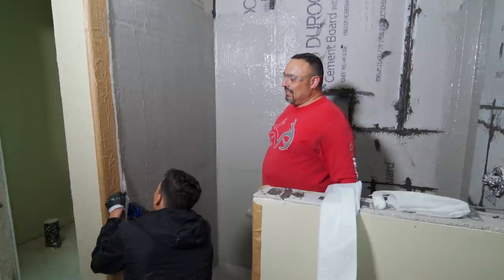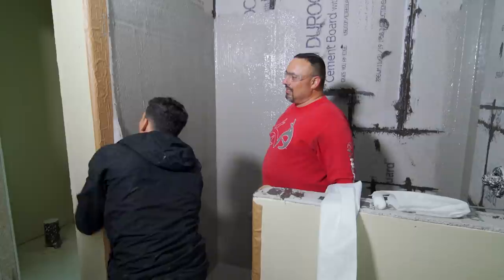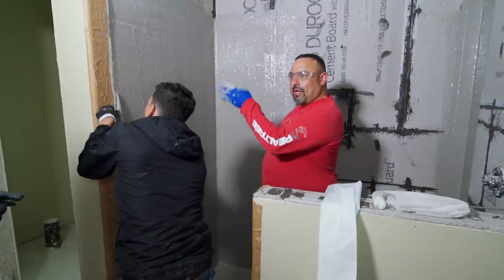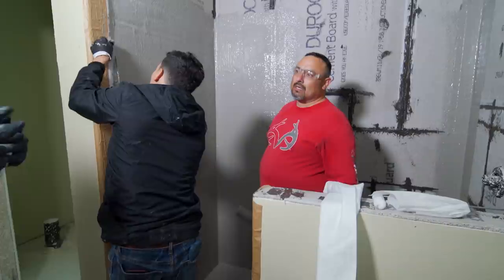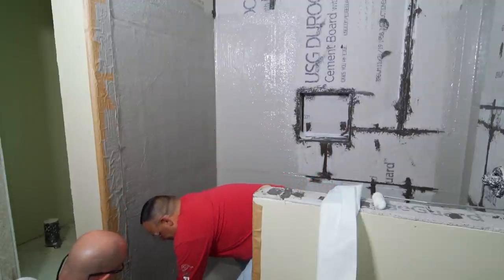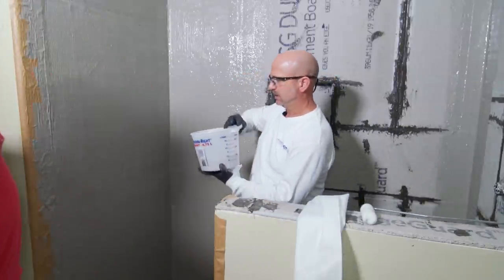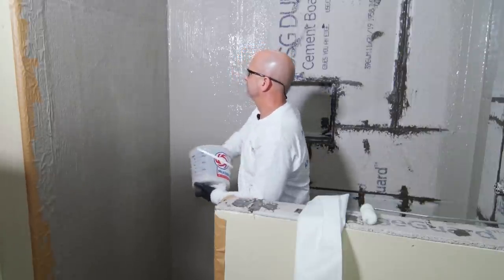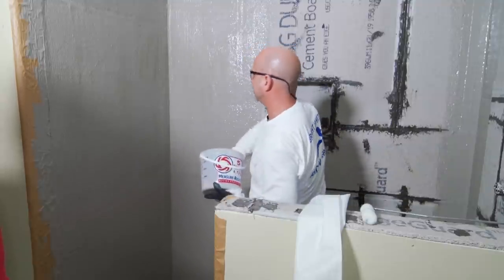The best practice is to try to do it aesthetically correct — clean lines, clean everything. You don't want the mortar guy slinging stuff around and have fabric not all the way adhered and sticking out getting in the way. If you left something hanging out and once it dries, you can cut it back. The difference: if you go to start cutting this and you've got all your sand thrown into it, it's going to be like cutting sandpaper. Start right here and give it a good run all the way up — not a lot of pressure, just a little firm. Stick it back to the wall. Let's say this is a full completed area. You'll do your walls first, then the sand gets embedded — fling it out there.